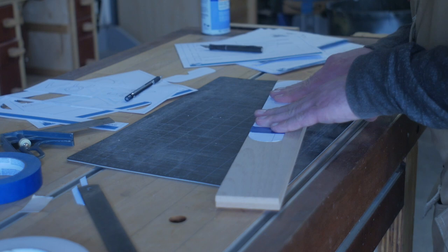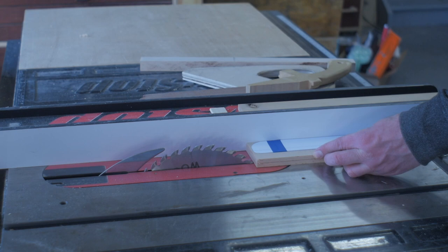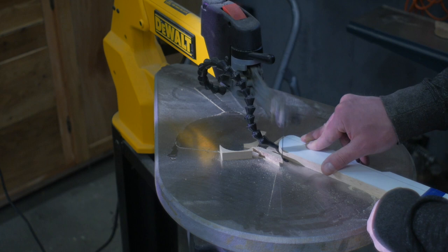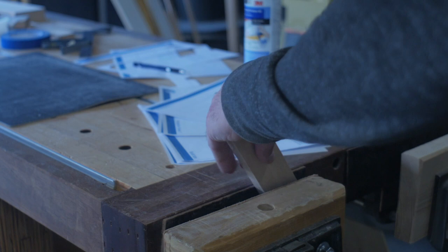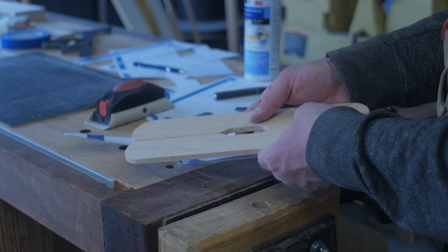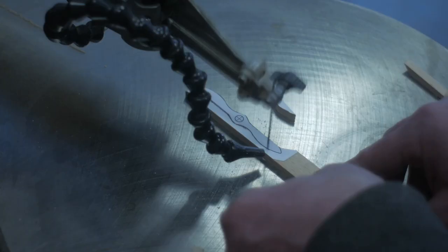The main wings are identical, so you can cut these out together if you stack the boards with some double-stick tape. These wings are also straight, so I cut them on the table saw first, then cut in the curves on the scroll saw. If you don't have a scroll saw, a coping saw will work just fine. The order in which you work on the different parts of the plane isn't that important, so I worked on getting the wings and some of the details finished before working on the body.